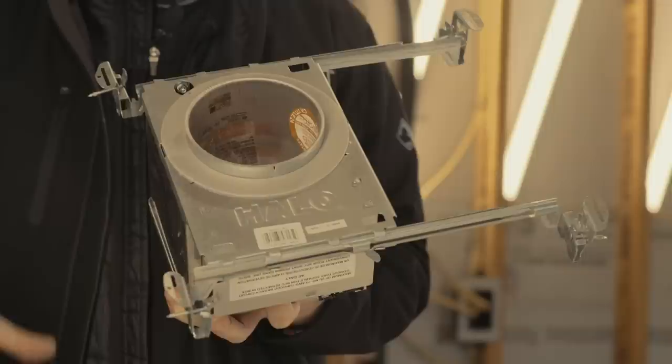Let me show you a few more of these fixtures. First off, secondary spaces — garages, closets, that sort of thing — this is a fairly thin fixture but it just has a standard box in the ceiling, nothing fancy, 800 lumen output. They make that in two sizes. Next up, in my kitchen I did use a little bit more of an expensive light. This is a light that's going to end up having a two inch aperture — a really small little trim, but a lot of really high quality light. This is a slightly more expensive fixture — this module right here is like 60, 65 bucks, and I still need to buy a $20 trim for this. It has a pretty normal looking housing like we've used for years. So all in, we might be somewhere in the 80 to a hundred bucks for each one of these between trim, can, module, all that sort of thing.